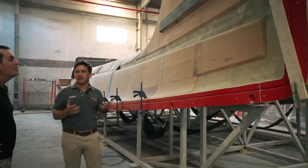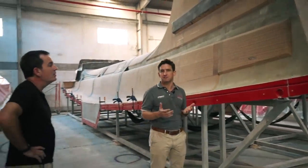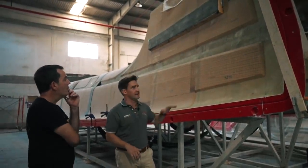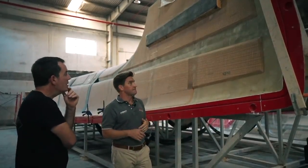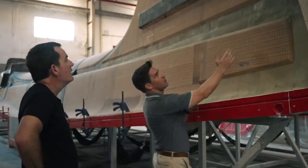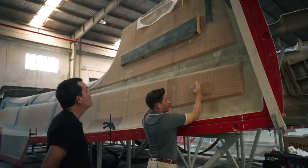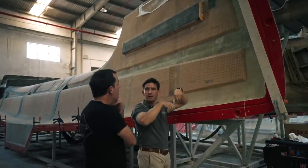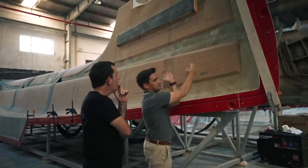We're looking at the inboard side of the 1370 here. Watertight integrity is so critical and hopefully it's not something you have to deal with. But people do hit things, whether it's just at the marina or really offshore, and understanding where your watertight bulkheads are is important. Firstly, we have our first full watertight bulkhead that goes in here — you can see it butts up to the end of the inboard stringer. That's a full composite bulkhead. For a long time we've had composite bulkheads glassed on the inboard side only — bonded on the edge and then glassed on the back face and the outboard side.